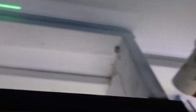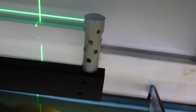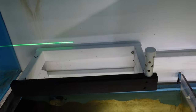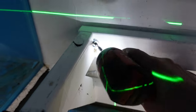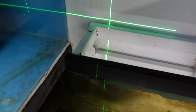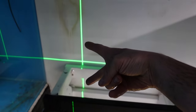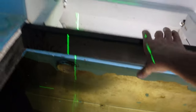You can see that the front's got to come up a mile, not so much that side. So I'm going to have to get creative with packing the front because the whole thing's twisted. The idea is I'll pack the front and then the weight of the tank will actually twist it into level. Alright guys, so that's level — I've got to re-tighten the bolt. I've got the big bugle screws in there, and also two timber screws skew-screwed — basically diagonal. So even if it tries to rip out, the two screws actually cross over each other; they're both in that hole there, and it should be solid as a rock.